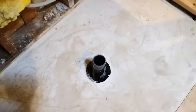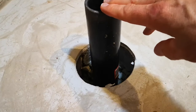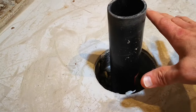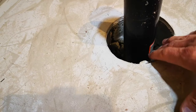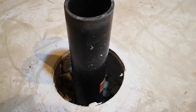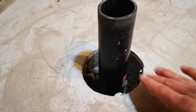What we need to do now is cut this drain pipe — it's sticking up too high from when it was installed. We need to cut it flush with the floor. The shower pan is going to fit down over that, and the drain pipe assembly is going to fit around this five-inch hole. That hole is to accept the drain pipe assembly — it will slip down over this pipe. Let's get started on cutting this drain pipe flush with the floor.